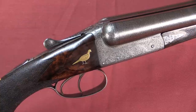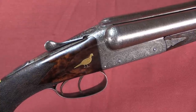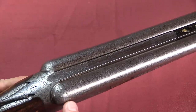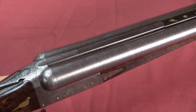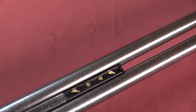So here's the thing about double barrel shotguns: the barrels are not actually designed to be exactly parallel. In normal guns they're not — in this one they are. Typically the two barrels, whether they're over-under or side-by-side, are intended to be angled just slightly towards each other, so that the two shot columns, one fired from each barrel, will actually converge at a predetermined point, a predetermined range.